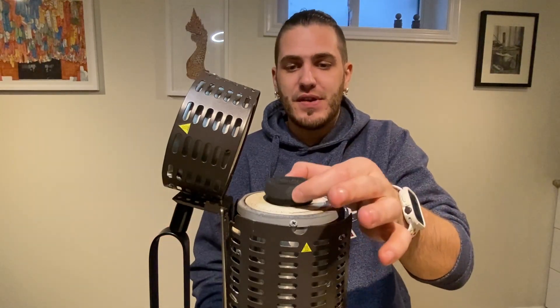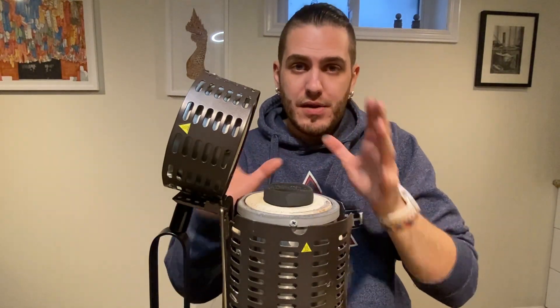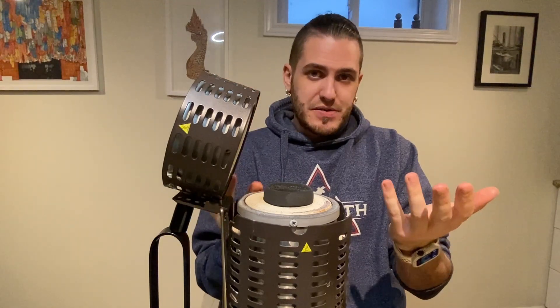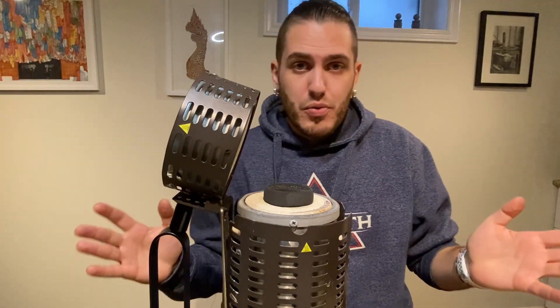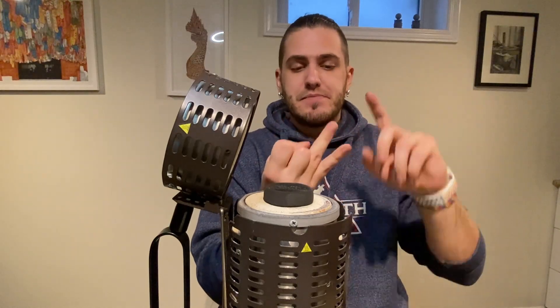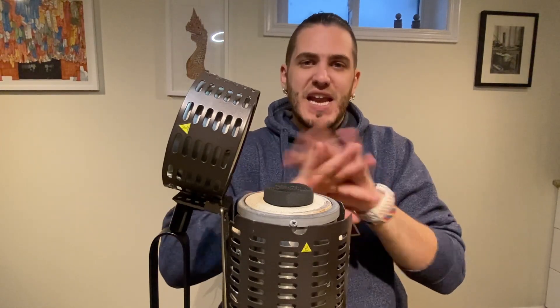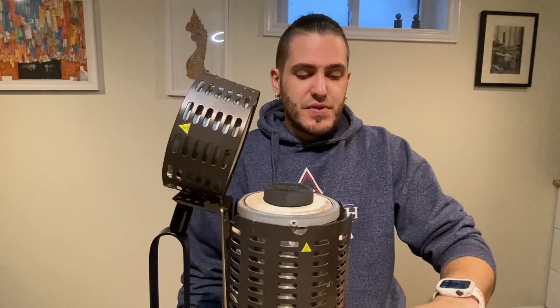As you can see by the size of this crucible, it's pretty good if you're only using grain metal — like brand new stuff. But I like to do the recycling method: 50% new material to 50% recycled material, all melted together in the crucible. You can recycle metal no problem after a couple of casts. You have to make sure there's no plaster investment left on it. I'll pickle it to remove all the oxide, then tumble them to remove anything sticking to it. That way I know the metal is clean.